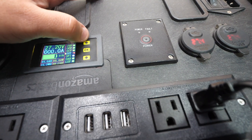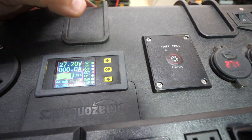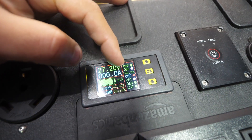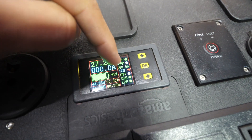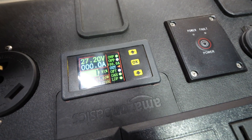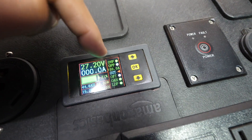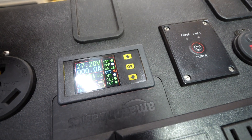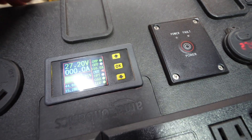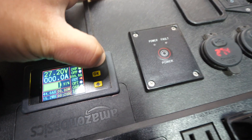Of course my cabling can handle more than a thousand watts, so we're going to turn that off. But there's another way to look at this: if your cabling, batteries, and all your equipment can handle a hundred amps, regardless of wattage, you can choose either watts or amps. In this scenario I'm going to choose a hundred amps and leave it there. A hundred amps is like 2,000–2,500 watts, which the inverter can totally do. My cabling can totally do it too.